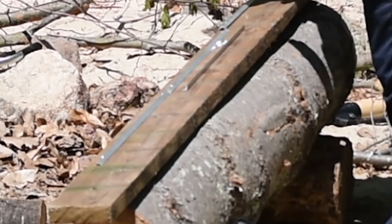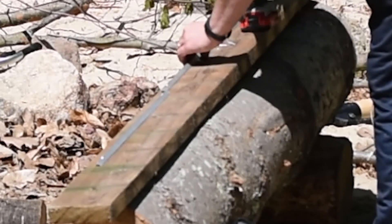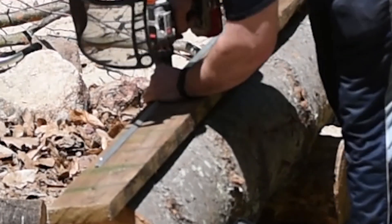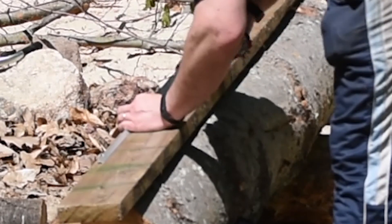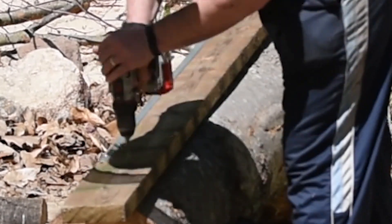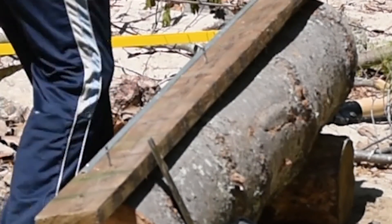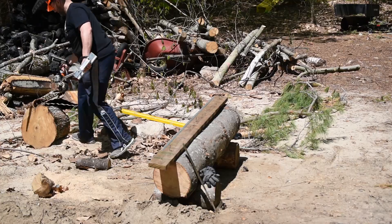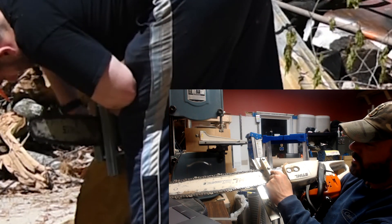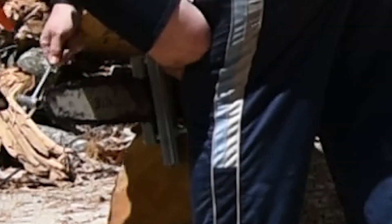Then I took these V-shaped bars that come with the mini-mill. I'm attaching it to the very edge, just about a quarter of an inch from the edge of that 2x6, and this is used for the attachment to ride along. I'm also securing the attachment to the saw's bar by securing those two bolts, which keeps the attachment secure to the saw and keeps everything square.